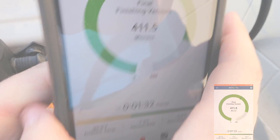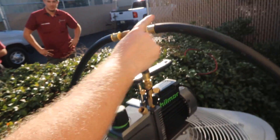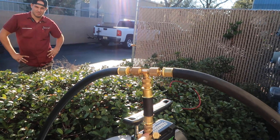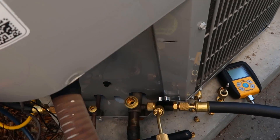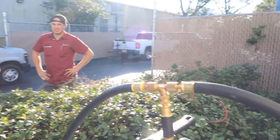Let's go through the configuration now: we've got two big hoses, a T — this is a 3/8 connector down to a 1/2-inch connector on the pump — two 3/8 connectors down to a 1/4-inch at the core tool, and a 1/4-inch connector at the core tool. These are half-inch hoses. Core tool on the other side with the micron gauge connected directly at the core tool itself.